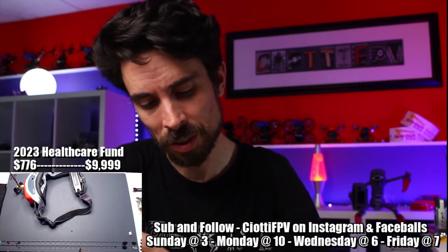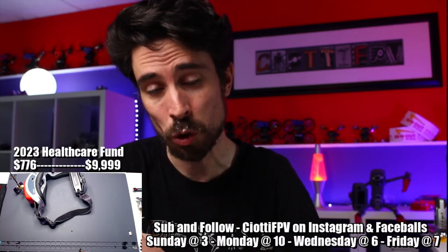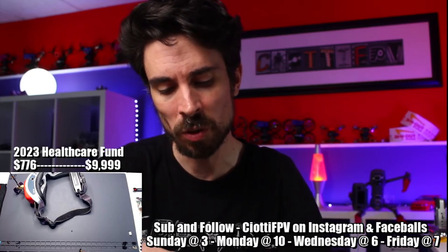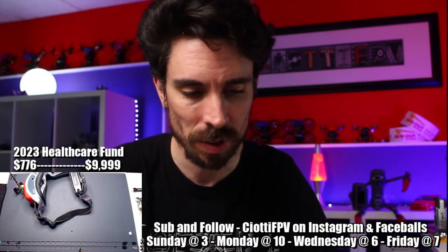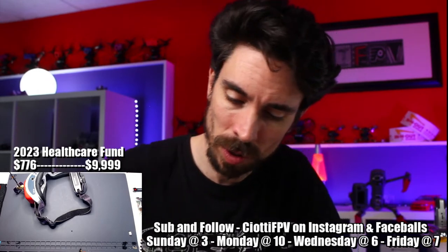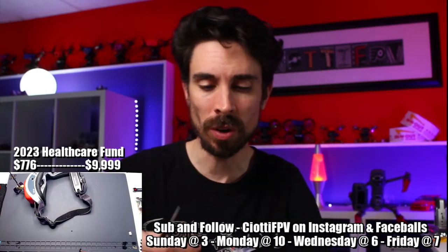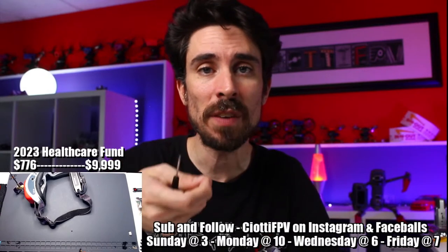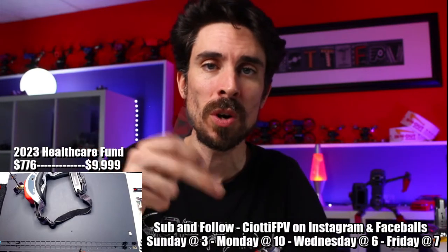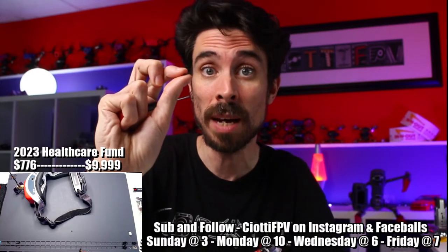I hope I didn't just kill these motors. I mean, two of them were spinning, and one of the other two that wasn't spinning was trying to spin, and I didn't check out the last motor that wasn't spinning. I didn't touch it to feel whether or not it was spinning. All right, so here's a screw that I pulled out, and here's a screw that I was using in the Acrobee, and yep, the Acrobee screw is shorter. So when you buy these 702s, this is now the second time that I'm saying this on a live stream. When you buy these Newbie Drone 0702s, they are going to come with a set of screws that are shorter. You need to use them.